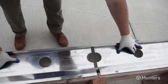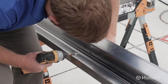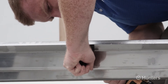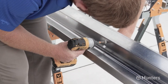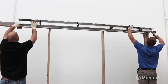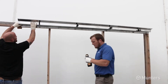Repeat for the remaining drip collectors, butting them up one to another. Locate the distribution cap and the plastic pipe holder. Fasten 4 pipe holders to each distribution cap using 2 pole barn screws, making sure all pipe holders are installed in the same direction. Hold the distribution cap up to the top framing so that the end is against the end framing and the long edge of the cap is aligned to the bottom edge of the 2x4.